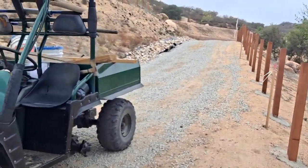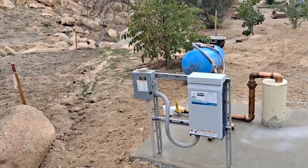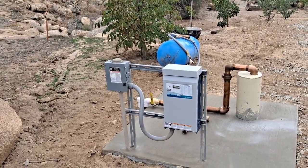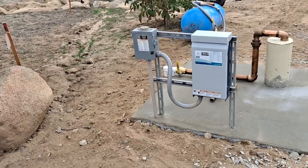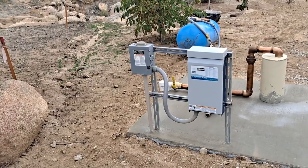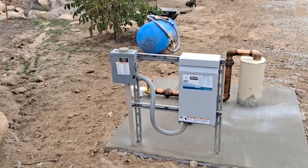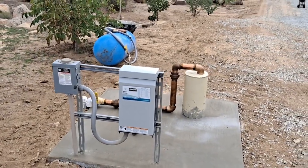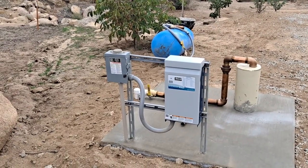It's 1-inch conduit. It pulled the 6, 6, 10, no problem. I really could have added another 6 and not had a hard time, except wire costs are high right now. For 500-foot spools, 6, 6, and 10 was like $1,000. And I do make the mistake of always pricing the wire without adding the conduit. So again, 400 feet of conduit, a sweep, that box, a sweep, this disconnect. You know, it was expensive. It was a couple thousand dollars realistically to get wire down here.